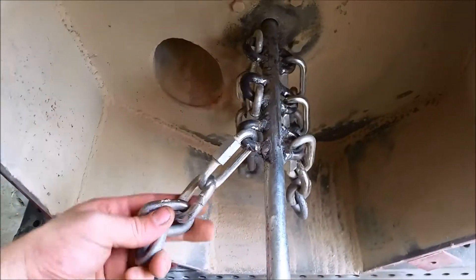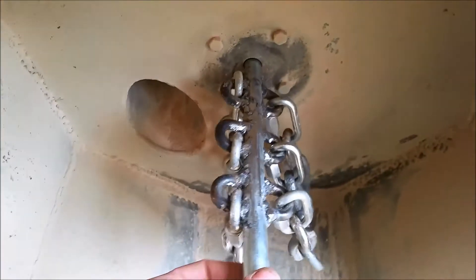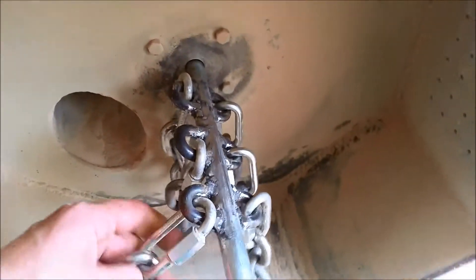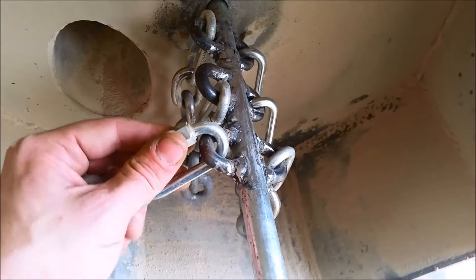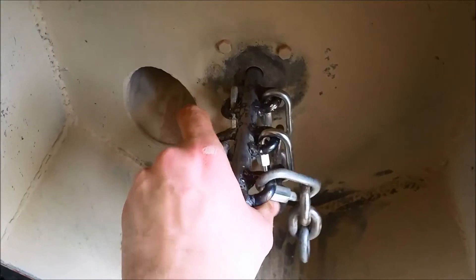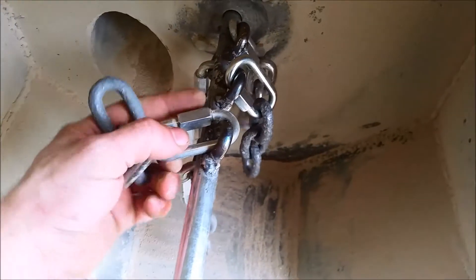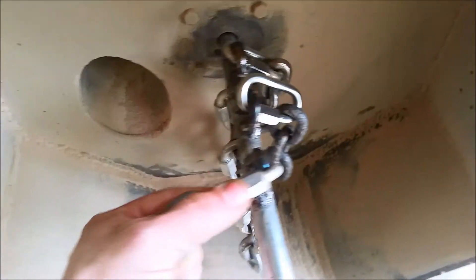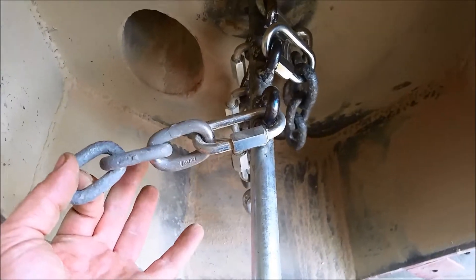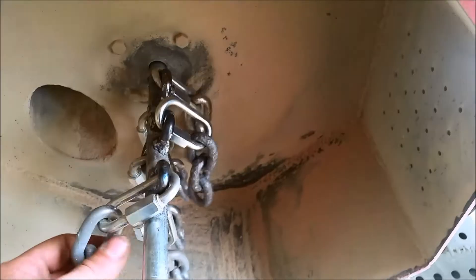Got everything in and got the chains put on - as you can see it uses these rings here. Now when placing the chains in, you want to make sure the locking ring is oriented so that this nut is not hitting the rocks. For instance, this turns counterclockwise, so the back of the ring is what strikes the rock. You'll get some rocks hitting this top nut every now and then, but that saves these rings - they're significantly more expensive than the chain itself. If you can't get the ring open to replace the chain, you'll have to cut it and buy a new one.